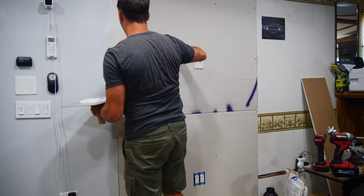No matter how good of a filter the shop vac has in it, it still creates a cloud with drywall dust. It's kind of amazing that it actually created a general haze that the camera was able to pick up. But this is the final sanding coat before adding texture, so you're wanting to make sure all edges are sanded fully flat, with no lips, and that there are no high or low spots.